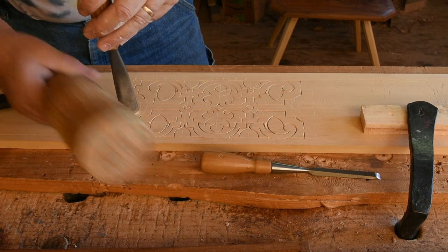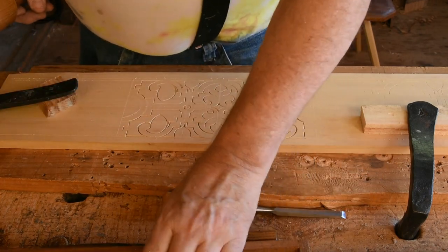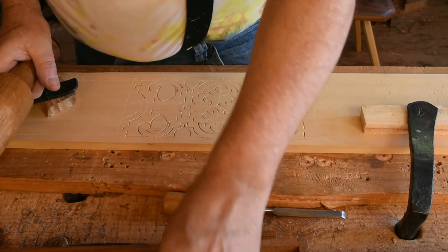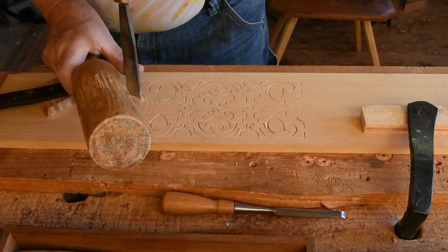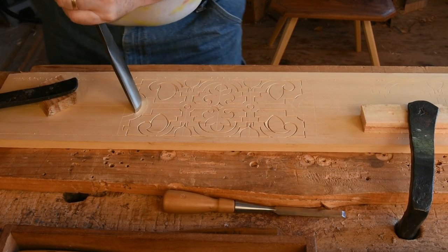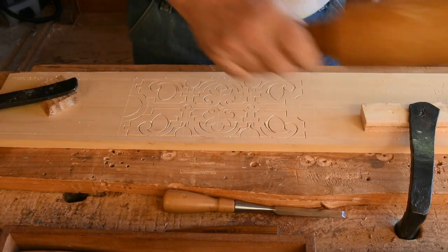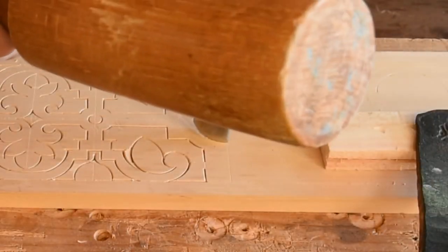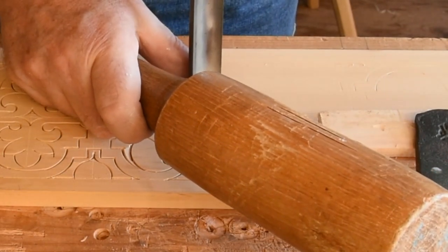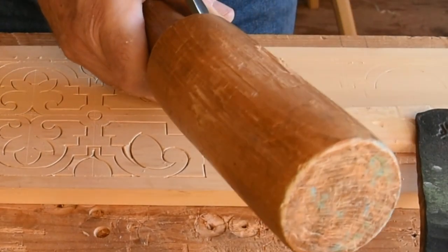The inside of that circle I incised that as well, but that's too flat, that's too curved. The first gouge, I used the big 3/4 inch one, looks all right. A big 1 inch one. This one's the center of the box, so it goes all the way around.